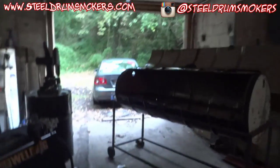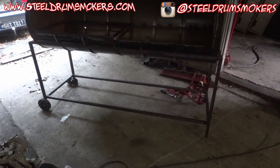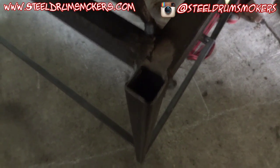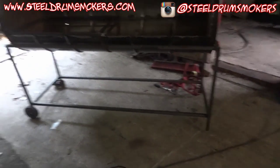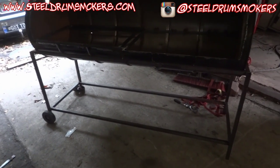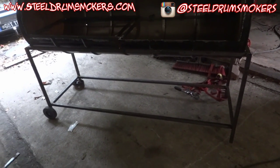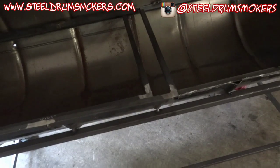This is going to be the top side of the crate and I have to skin it. The frame is made out of one-inch square tube - I believe it's 16 gauge. This whole frame ended up being close to 40 feet of one-inch angle, with a couple pieces left over. The frame itself ended up being close to 20 feet.